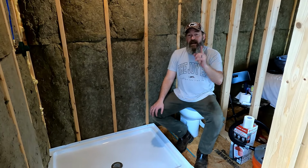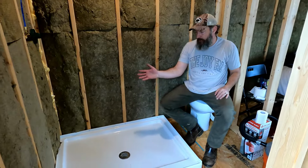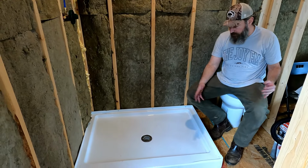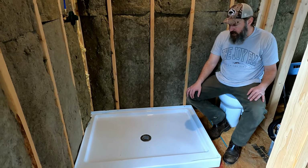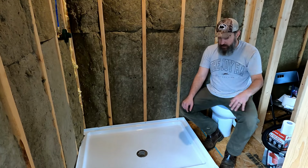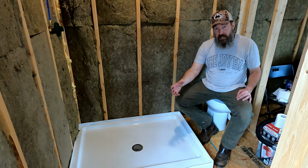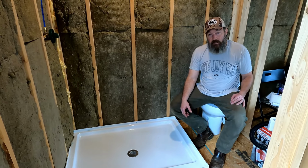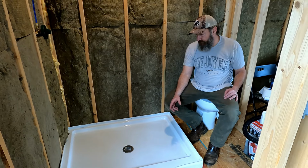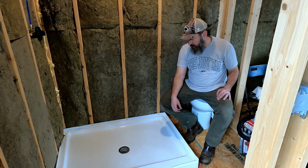There you go. I misspoke. It was a 3/32 drill bit, not a 5/32 drill bit. So if you're going to use those number 8 screws, I think 3/32 is the way to go. It probably took me more time to get that hole straight than anything, which I did off camera, just because of the way that it was drilled. I would highly recommend just going ahead and getting yourself a 4-inch hole saw, because it's so much easier and cleaner and neater. But it's neither here nor there.